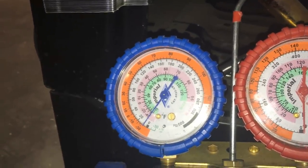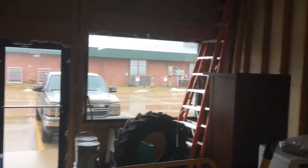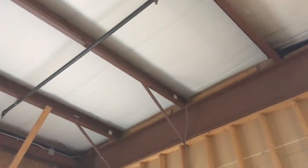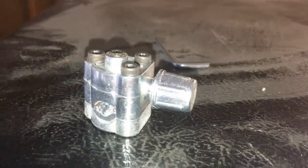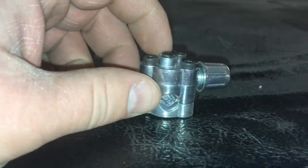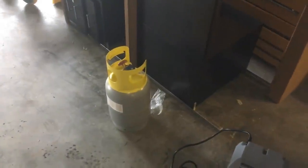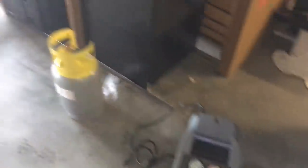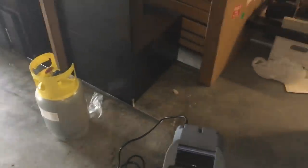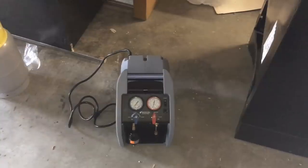There's a little bit of pressure in the system, but not much. It's basically flat on gas. What a rainy day we're having today — I love the sound of rain on a rooftop. As it happens, I decided I wanted to save the bullet piercing valve that was on this system. I know these things are not worth a whole lot of money and I don't have all the pieces to this one, but a tool saved is a tool earned. So just to stay on the right side of the EPA and everything, I went ahead and hauled out the recovery machine and my tank of contaminated refrigerants. I pulled off whatever this thing would give me. There really wasn't enough in there to even do a proper job of purging my hoses, so I wouldn't be surprised if I've managed to put some air into my tank of contaminated refrigerants. But I just wanted to make sure that everything was staying as legal and above board as possible, so I erred on the side of caution.